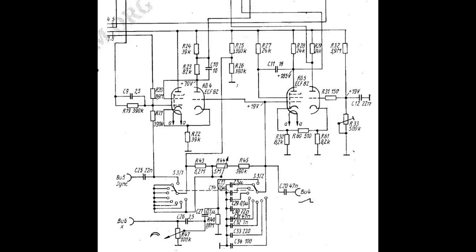Looking at the schematic, you can see the feedback: the signal from the vertical input goes into the sweep generator — the sweep oscillator — and then you have a variable sweep. The trick is to adjust those two potentiometers so you get a steady picture. This is how all those scopes were made back in the day: the sweep oscillator must run all the time, but by feeding in a signal from what you're measuring and adjusting the variable speed, you can hit the sweet spot where the picture stands still.